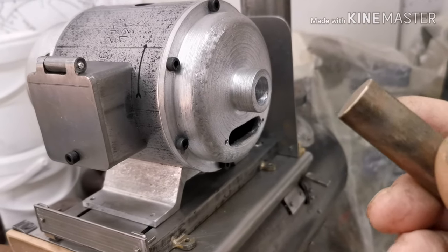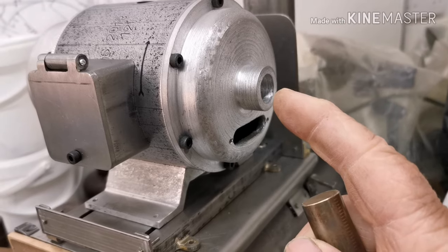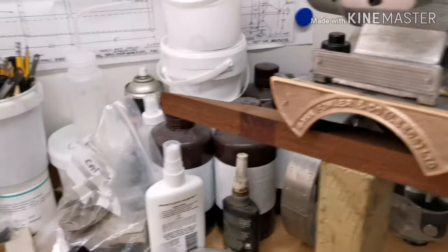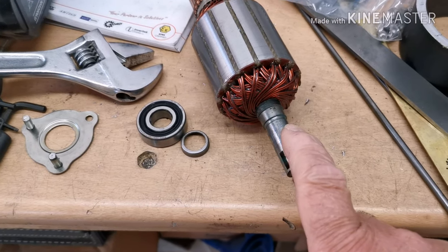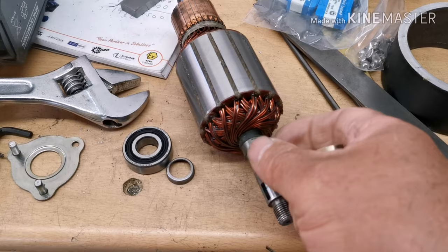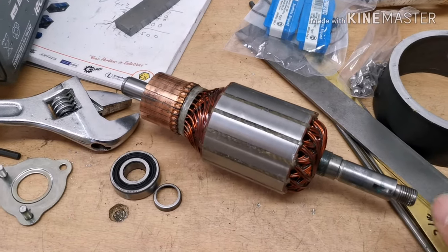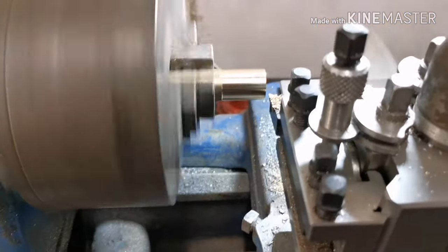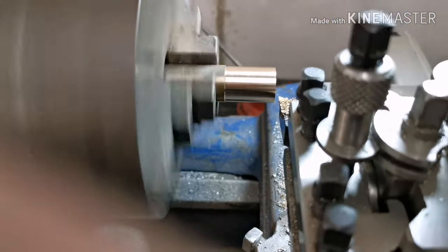I had some material delivered so I can get on and make the bearings for the ends. A pulley turned up so I've got the bearing off of there, and I can now make the bearings and turn the shafts down each end. Just turning up the bearings now.